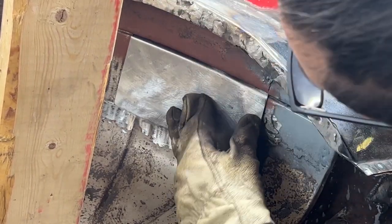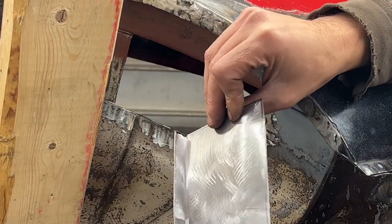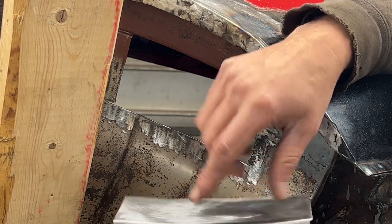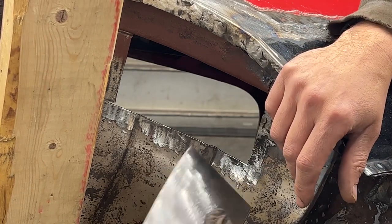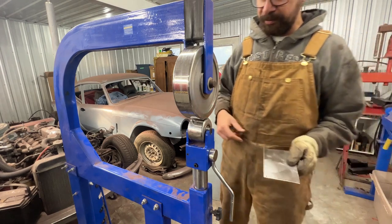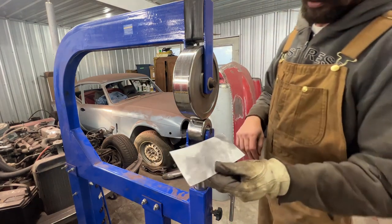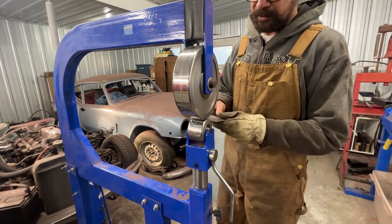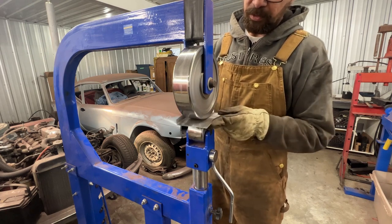The curve is pretty good now here at the top, but the bottom needs to curve more, and we also need to curve it a little bit this other way — we can do that on the English wheel. We did this on the stretcher but here this didn't follow much, so it's much straighter. On the English wheel we have this die which has a very slight crown — almost straight, but it has a crown. We want more curve here and less there, so we put it this way: when the English wheel stretches the center, it's gonna curve it both ways. So that's the area where we want more — we're gonna go only here first.